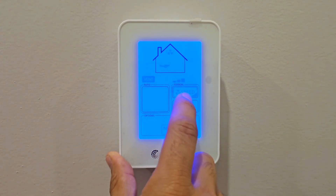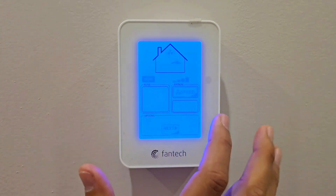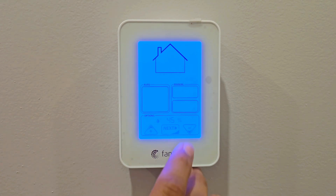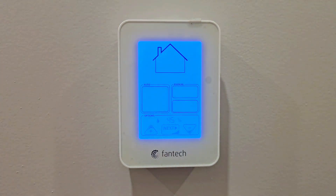For example, you can set Vent at medium speed for night. The next setting shows a sun icon for Day preferences, where you can choose your ventilation, recirculation, or off setting for daytime. After that is the relative humidity setting. The default indoor relative humidity range is 30 to 80%, with a default of 45%. As outdoor temperatures drop — like to minus 30 or minus 35 — you can reduce it to 30 or 35%. Press Next to confirm or return to the main screen.